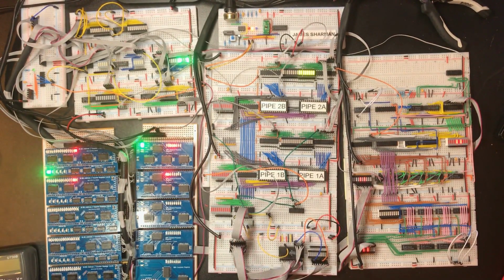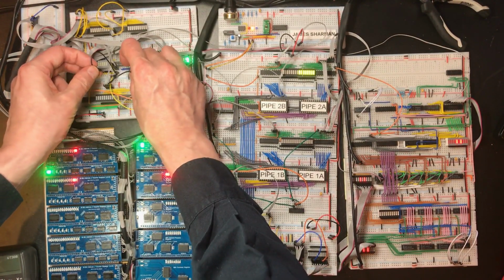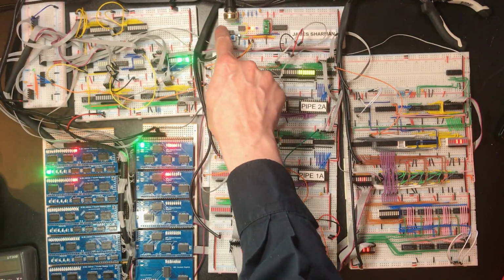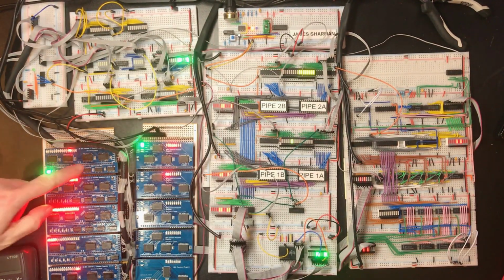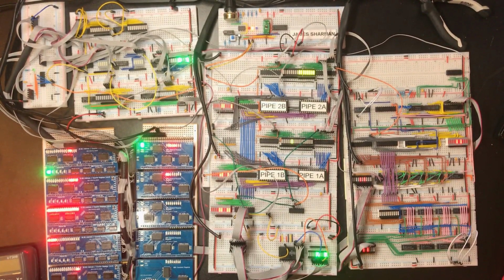Okay, both inputs should be at ground. Pull it down directly just to eliminate that. The counter chips here are very, very quick. I think they're capable of 40 megahertz counting. So the amount of error on that line to create the extra clock is very, very low.